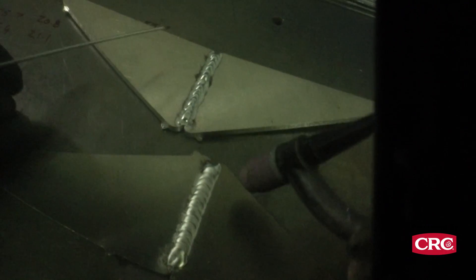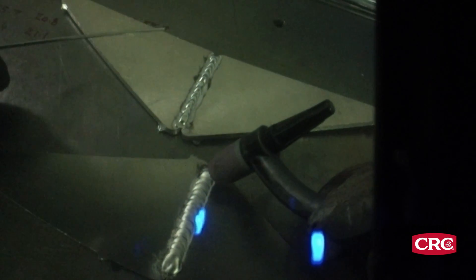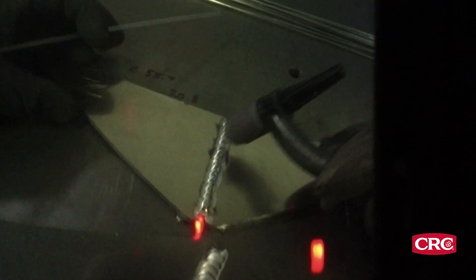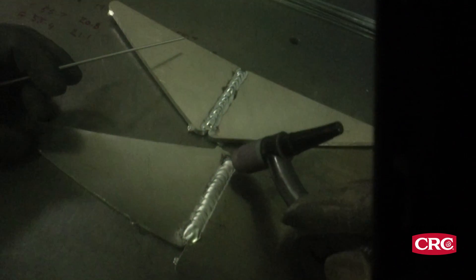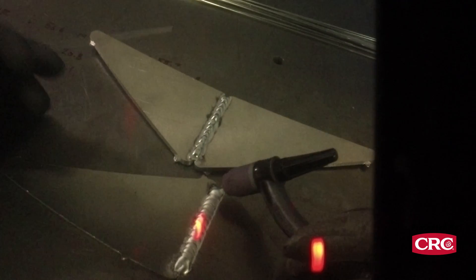See that puddle is huge, and I'm also going slower — that's how I'm keeping the heat in. I actually felt my TIG torch starting to boil there. The dimes came out okay, but look how wide that is from almost too much heat. Notice how this one is shiny and this one is gray — when you're too hot it'll come out gray, and when you're cold it'll come out shiny.